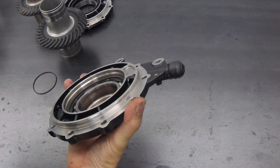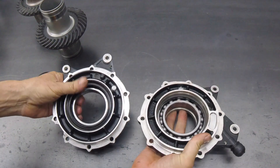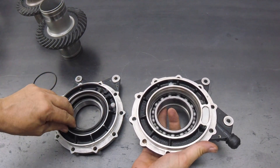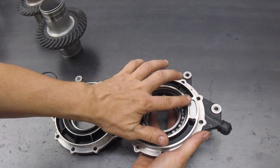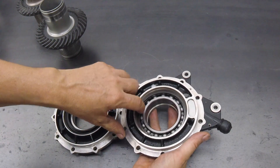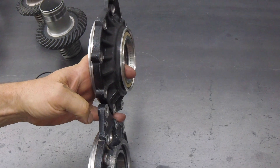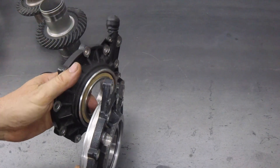So what are the geometric differences between these two? Starting with the fact that we don't have a seal on the inside anymore on the new design, we don't need some of this material here. You can see there's basically a big empty space where that seal used to be, and they actually trimmed some of this face down because it's not needed for supporting the seal anymore. On the other side, where they added the seal, you can see that the new style final drive sticks out considerably farther than the old one, because they had to make room for that seal holder on the outside.